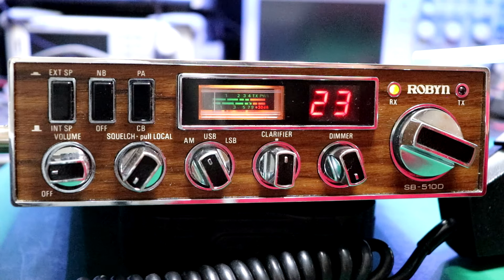The components they used in them, in my opinion, especially by today's standards, are top notch. This radio puts out a nice solid three and a half watt dead carrier, RMSing to about four watts, which is great.